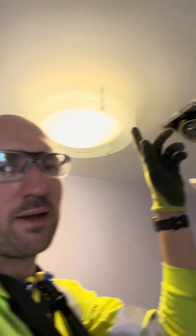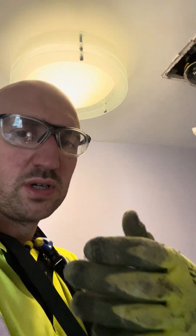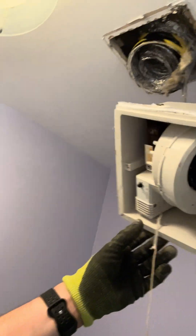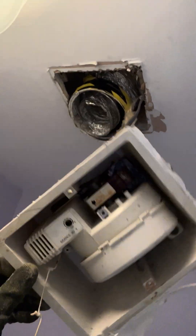We're going to put a little condensate trap in there because of how the pipework is installed — it's like a big drop. So if it gets condensation, it'll run down into the fan. But if we put a standalone condensate trap in, it'll just trap that and stop the damage to the fan. We're just going to swap these out — it'll definitely be better than that.